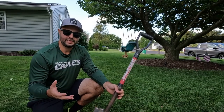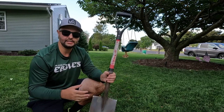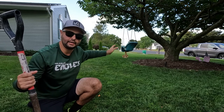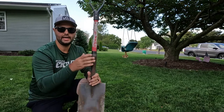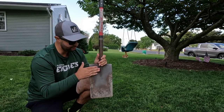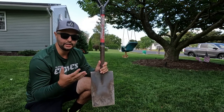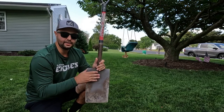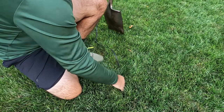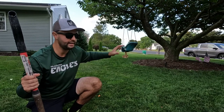The most difficult thing you're going to face when putting in landscape lighting is if you want to branch off of your main line — but it's very simple to do, especially if you're dealing with grass or dirt. It's very easy to just dig out a trench and branch off of that line. I wanted to branch off the main line in front of the Christmas tree and uplight these trees right here. Very simple process — I got my spade out. Any kind of straight-edge shovel would do. This one's deep enough where if you don't have to dig a full trench, you can just slip your landscape wiring down because you're dealing with low voltage wiring — nothing super thick or hard to deal with. If you can get down and wiggle that sod back and forth enough, throw that line down, and then over time you're not even going to notice it's there. I don't even notice mine anymore — I probably wouldn't be able to tell you exactly where it is in my lawn because it's been about four years since I buried that line, but I haven't had any problems. These trees get fully lit at nighttime — I'll show you here in a little bit.